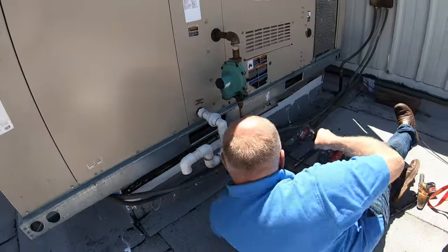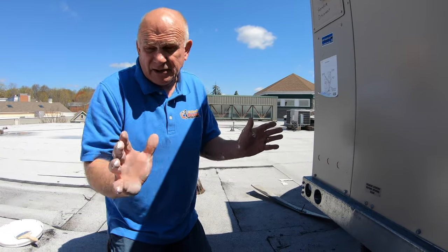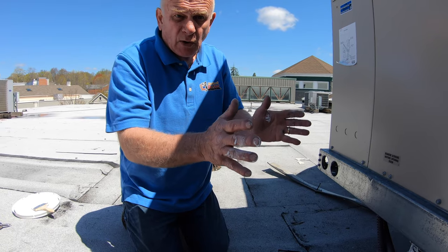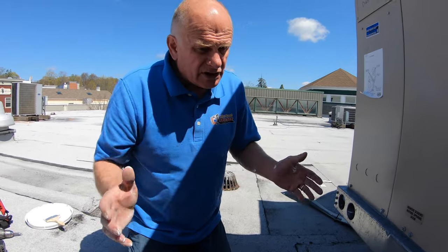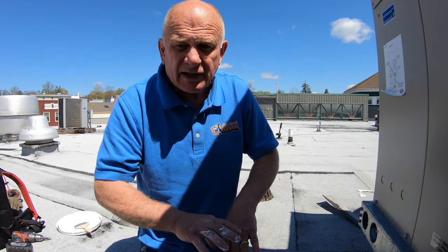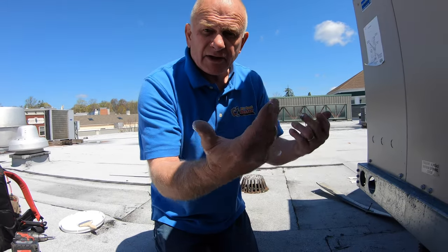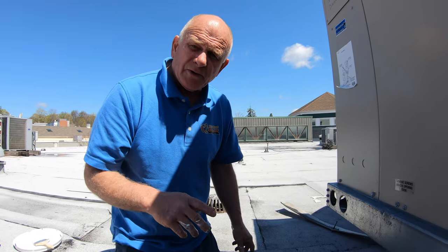Beautiful — that's an AC unit without a curb. I extended the roof all the way up. There was an EPDM roof so I couldn't just put a torch on it — it's complicated — but I made an easy fix using super silicon seal and brought it all the way up underneath the flashing of the AC, which is not very much, but it works now.